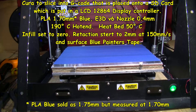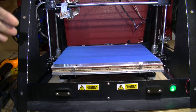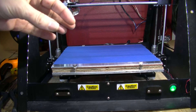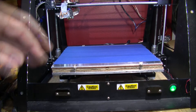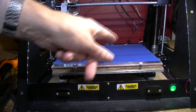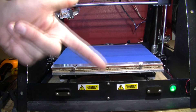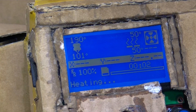I'm asking for a 50 degree heat bed temperature, so those are the main settings I've changed. This will be a different model to what I did earlier but will give us an idea of the stringing. I want to print this pretty hollow because I want it to print quicker — about three hours — and I want to try it for size before printing it out solid. I'll stop the video and restart when it's starting to print. Here's the controller set to 50 for the bed.